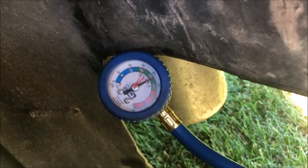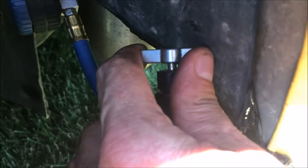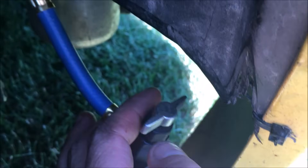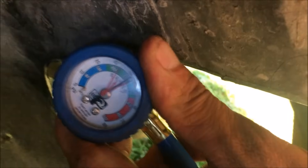The system is normalizing. I have run out of fluid. Now because it's above 85 degrees out, I think the reading would actually be higher. The fans have kicked on. You have to toggle this switch and watch that gauge — all the way down is off, but slightly up is on. If you go up too far, it turns back off. I was sitting here for 10 minutes with the valve all the way up. It's real close to being all the way closed. It actually lets the fluid flow and you can feel the coldness on this section. If that isn't getting cold, you don't have any flow.